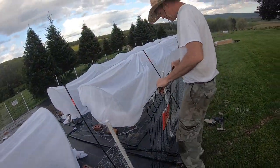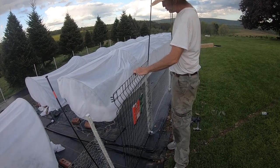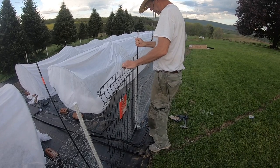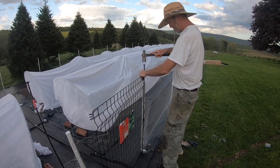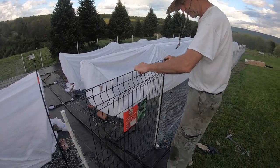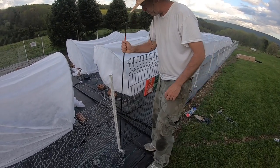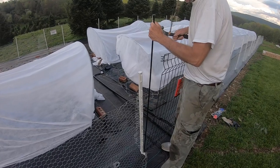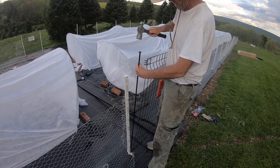We figured out the distance we needed and got these rods. The gate and two rods together is around $20. It has a hinge on the side, so we're going to run the stake down through the hinge and keep it fairly close to the post so nothing can sneak by on the side. We're just going to drive it down. You don't want to drive this all the way down because the whole idea is so you can lift it up and swing it open — you want to leave enough play. We want to have a stop so the gate doesn't swing in. We want it to be stable so it'll hold the gate in place.